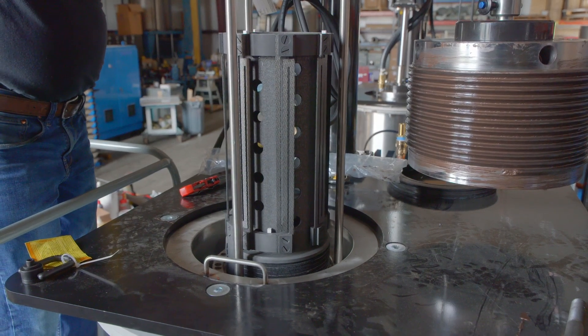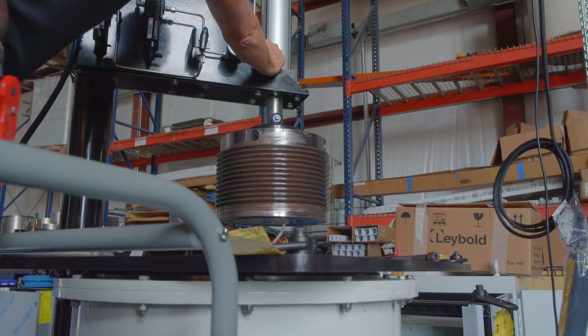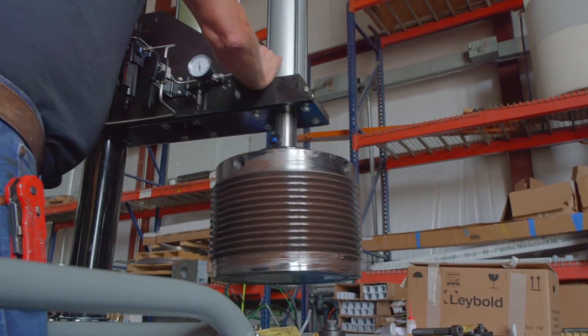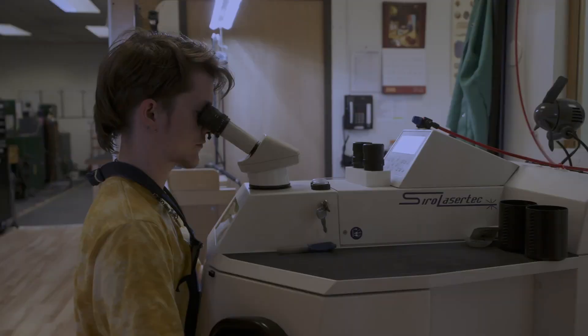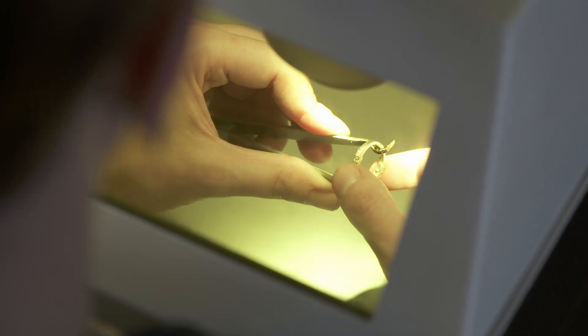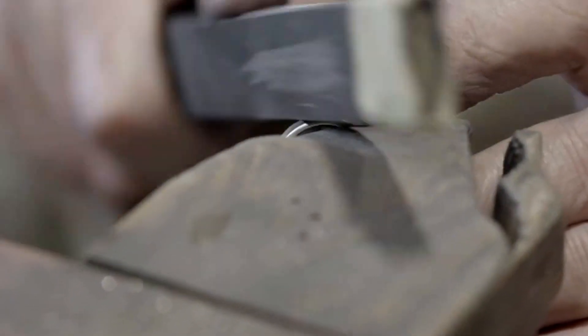The customers love it, and the reason they love it is that they have a predictable piece of metal on their bench. If you apply the HIP process to that casting, you're not going to have to stop and rework as much. You're not going to have that cycle where you go to the laser, repair everything, go back to the bench, blend it, and then other porosity comes out in other areas.